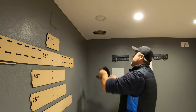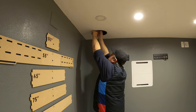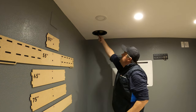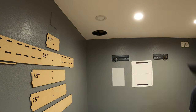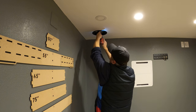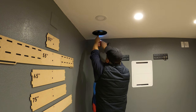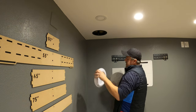The next step is to drop these in — that should be a nice fit in the hole. You just pop your wings out by hand. You'll see that the wings that actually hold the speaker are coming down a little bit. We've got a little bit of dust on our hands. Now we're just going to take our impact driver and not tighten these all the way — just enough so the thing doesn't move. Here's your magnet for holding your grill. Pull this up about three-quarters of an inch. This is the Clips one; I know Origin Acoustics makes them, and I believe Sonance does also.